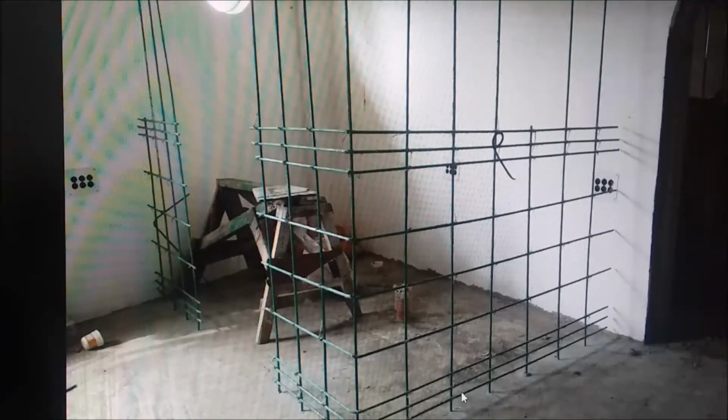Now, these are drilled into the floor down here about 3 inches, but they're not drilled into the walls. The dead weight of it here should keep her from going up and down. But in earthquakes, they propagate, it's a wave. It does go up and down, but it also goes side to side. And those drilled in there, and the fact that it's L-shaped, will keep it from going any place. They'd probably get a hairline crack in the skim coat all the way around it.